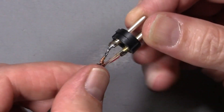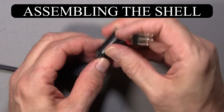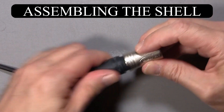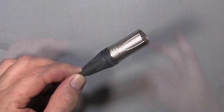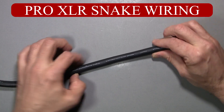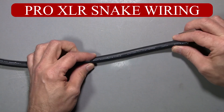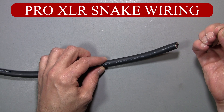There should be no bare wires exposed. Now I'm going to show you a slightly more professional approach to wiring XLRs. This is Mogami multi-pair microphone cable, which can also be used for line level. By pairs, each pair is a different audio channel — this is 8-pair cable, meaning in this one jacket there are 8 channels of audio.